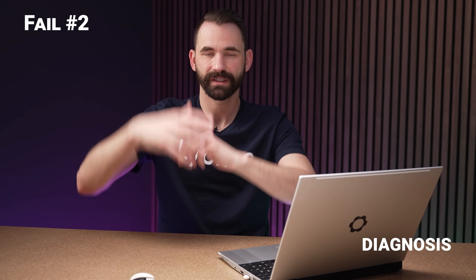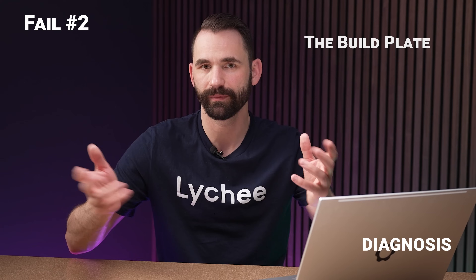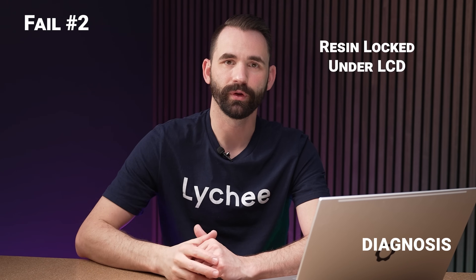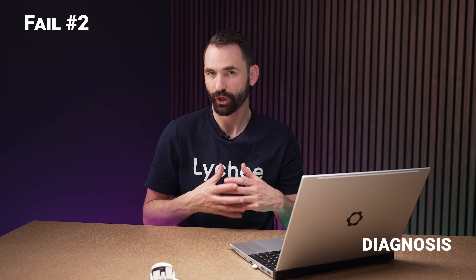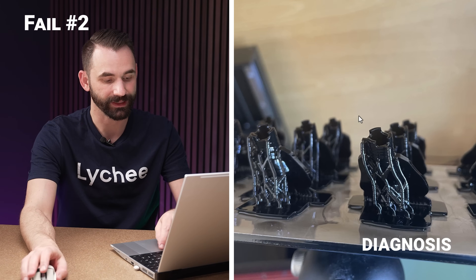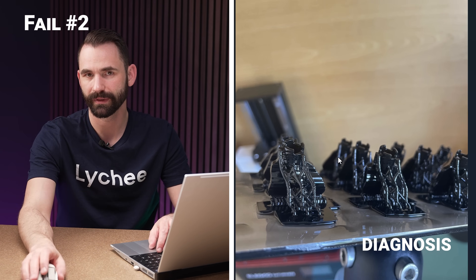Whenever I see things shifting like this, that tells me there's something physically not stable — we're getting movement on XY. The only thing that can really move on XY is the build plate. The LCD can't really move. The vat moving won't cause issues because when it goes up and comes back down, it lands on the same place as the LCD. So the build plate must be moving, or there's one other thing: if you've got resin under the LCD, it causes the resin in that area to not cure all the way through — it's really weak and flimsy like a wet noodle.